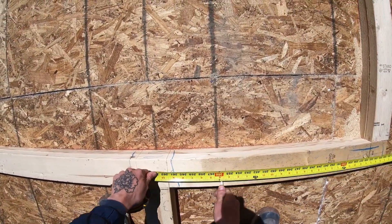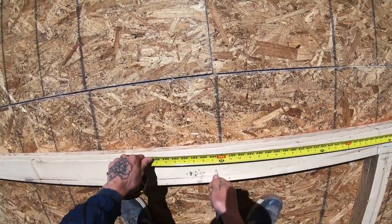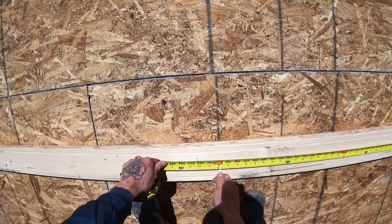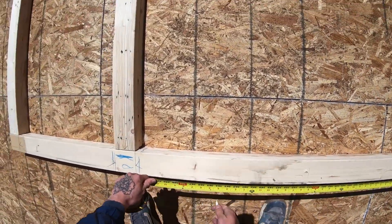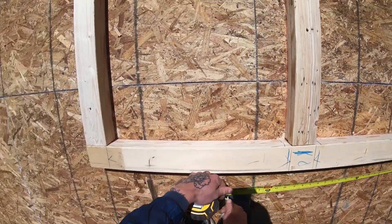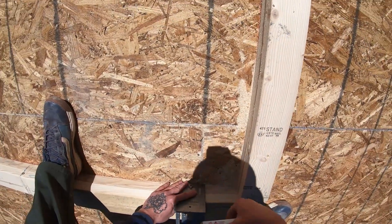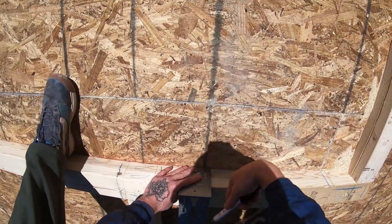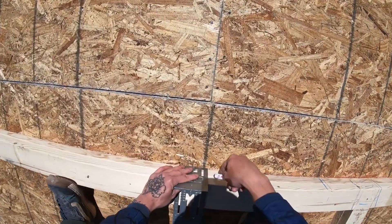You can see that lines up right over our joists below, which is just one of the most satisfying things. I'm marking on the top because I'm going to use my layout square again — it's just a Husky layout square, they sell it at Home Depot for like $10 or so. It's a really nice tool and we use it pretty much exclusively when laying out plates in this manner. I recommend anyone who wants to be a lead framer buys it.